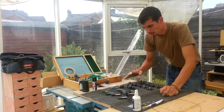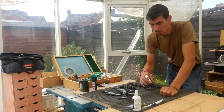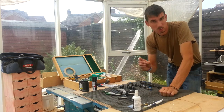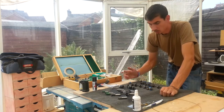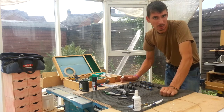The next thing I'm going to do is take the bearings off the individual cutters. I need to be careful because I don't want to mix bearings with other cutters — some of them are zero tolerance, so they're paired with the bearing to the cutter, particularly the round overs and profile bits, which is most of them. So I'll take those off and then I can spray those as well.